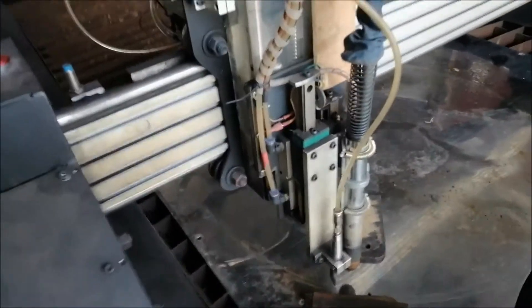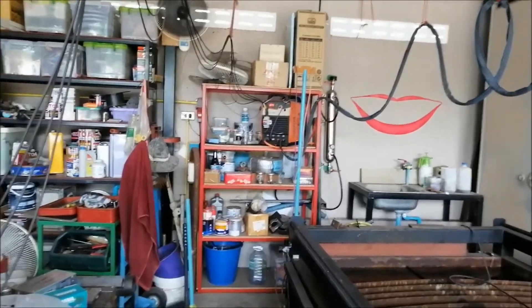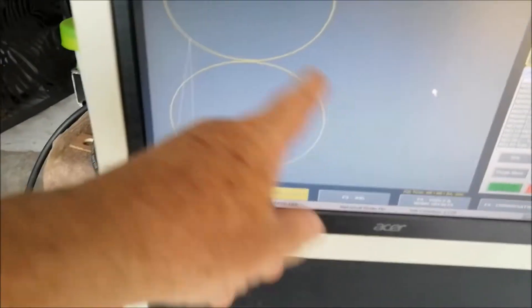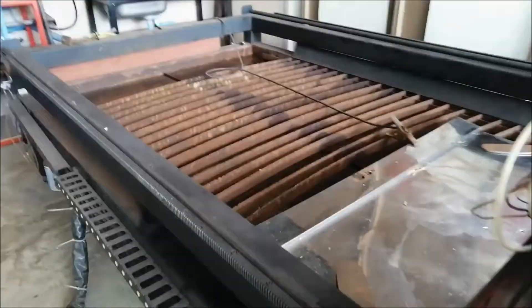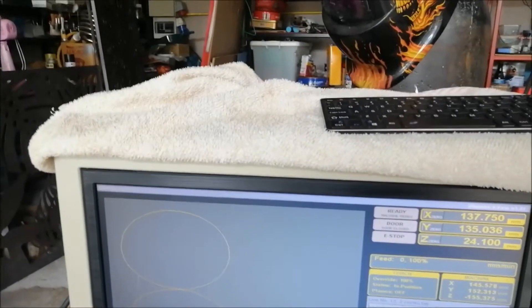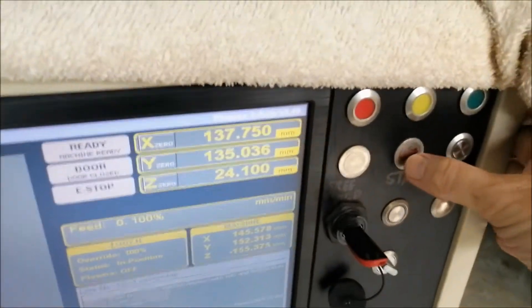We shifted the piece of stainless forward — we'll just do the one cut. I've actually dropped the plasma cutter down to 24 amps this time, a bit less. We'll just cut this one out, and then I'm going to pause it before we get to the next cut, or else it's just going to crash into the slats. I've rewound it already — just doing it again to make sure. Let's start it and see what happens this time.